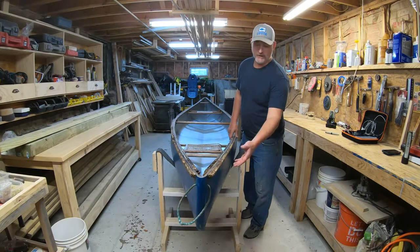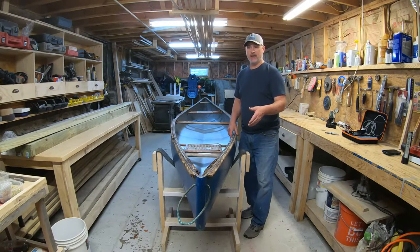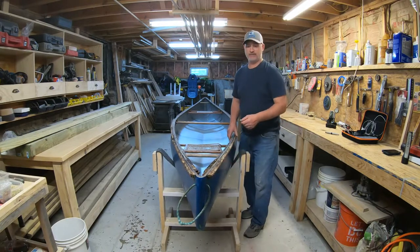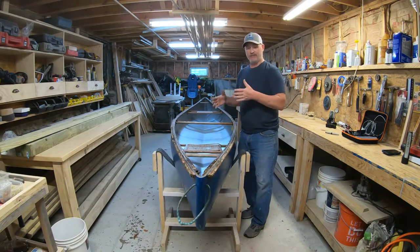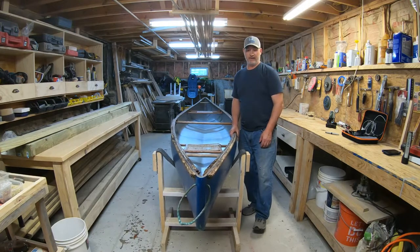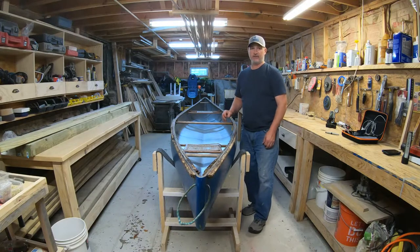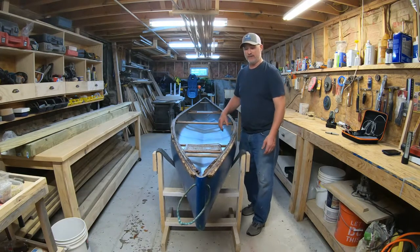For the cold cracks, I'll drill a hole at the bottom of where the crack currently terminates, and then I'll use a saber saw to enlarge that crack up to the screw hole, and then bevel it and file it and create a receiving boundary there for some G-Flex epoxy. Apparently that works. The only thing aesthetically which concerns me is not so much the exterior, because the exterior will get painted, but the interior.